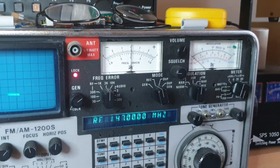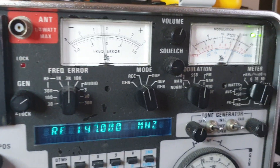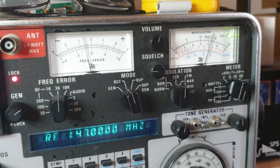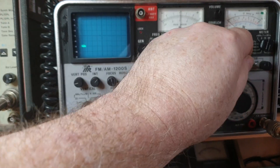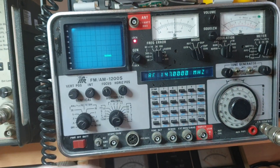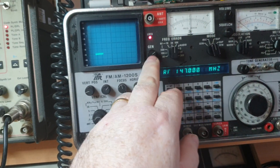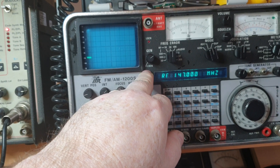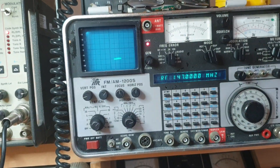They're a little bit finicky. I do like the Motorola for sideband resolution better. Certainly working fine there — pretty happy with that for sideband operation. Don't forget you've got to go to sideband on the 1200s and you need to take your generator lock off. Then you'll resolve your sidebands from left to right basically. When you go back to FM, just flick it back over to FM.